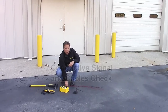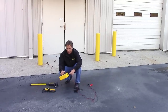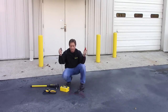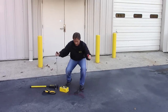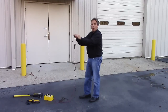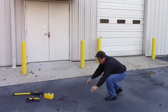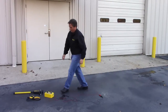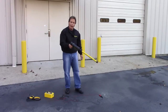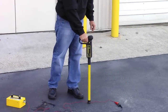Next, let's check conduction on both high-frequency and low-frequency. Plug your cables into the transmitter jack and hold the clips by the rubber boots. The transmitter gives a poor signal tone because the cables aren't connected to anything. Connect your clips together — the transmitter makes a high-pitched tone indicating good signal and good cables. Then lay your cables on the ground in a loop. With sensitivity still set at 2, touch the red wire with your receiver. The beeping tone indicates high-frequency conduction is operational.